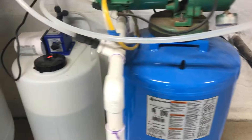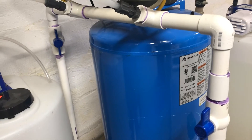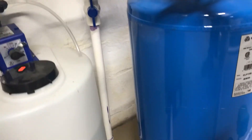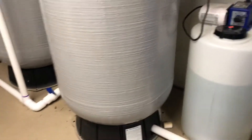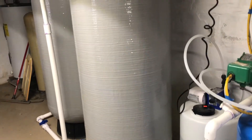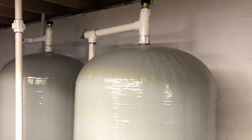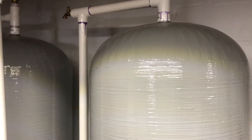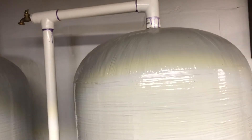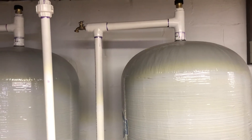These two chemicals are injected right here. Like I said, I have ball valves on either side in case I need to do any kind of maintenance, so I don't have to drain the tanks. Water goes down and into the bottom of the first holding tank, then exits from the top to give it time for the alum and chlorine to make contact with the water. They say you need a minimum of at least 45 minutes of contact time, and I have more than enough water here.